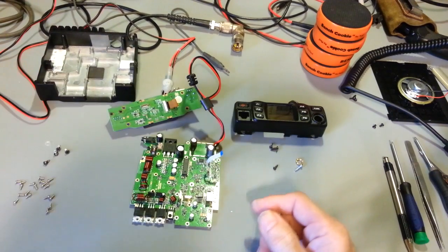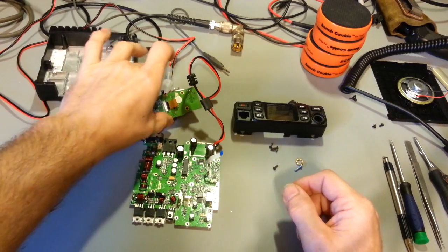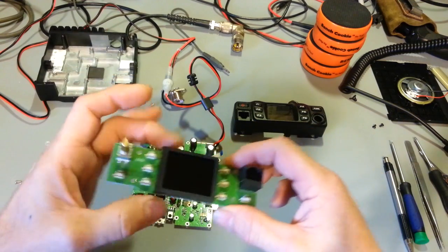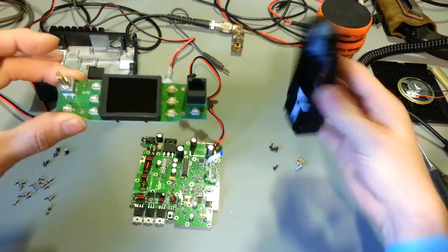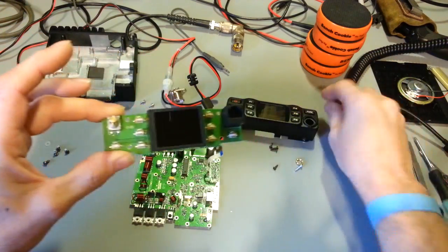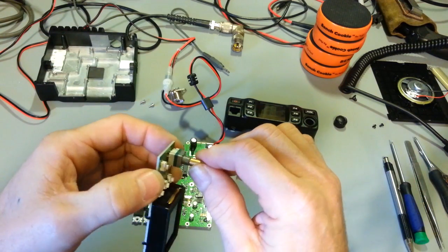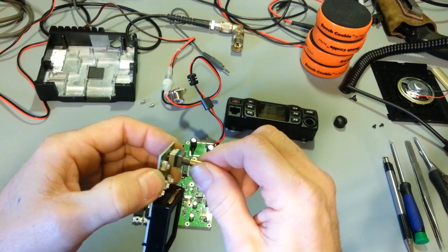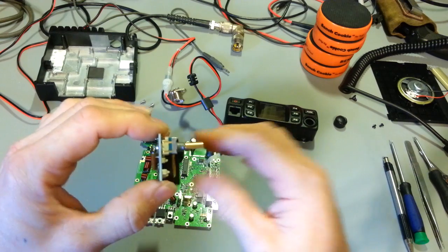Board layout and design looks very nice and compact. It's a little tricky to get into. There's not actually a lot to the display - encoder, switchboard. The knob just pulls off, it's a D-shaft, and this is also a push button. It has really nice detents. I'm going to have to remove this to get some manufacturer markings off the back side, because that encoder has some really nice detents.